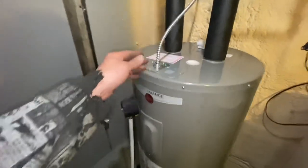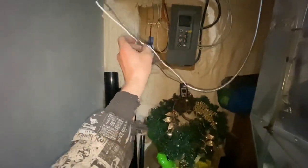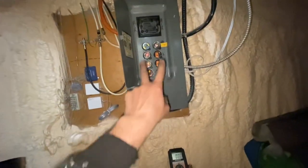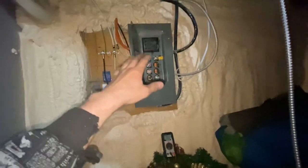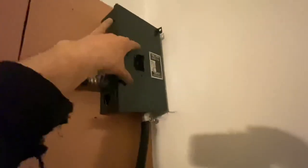This part is connected — now you run your wire to the fuse box. At the fuse box we're going to put red tape on the white wire so that in the future an electrician knows this is 240 volts. It doesn't matter if you have one row of fuses or two rows — I'll show you how to hook it all up. First you need to cut the power. In our case there's no switch on this fuse box, so there's another fuse box feeding it and we have to go to the garage to cut the power.